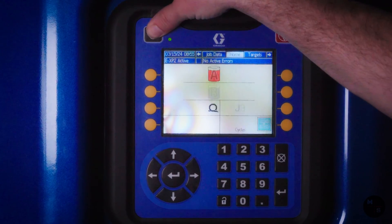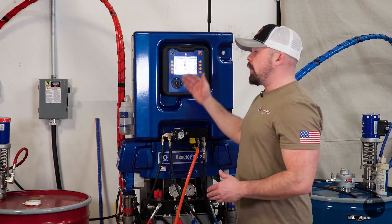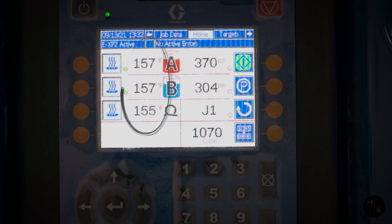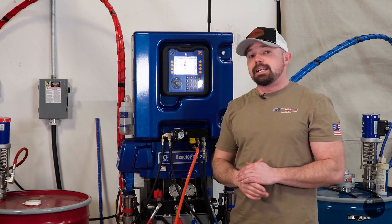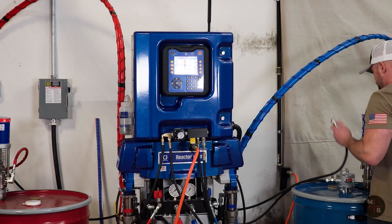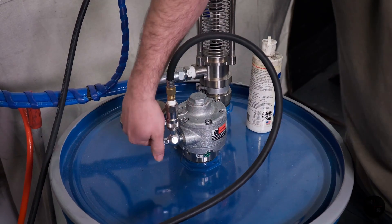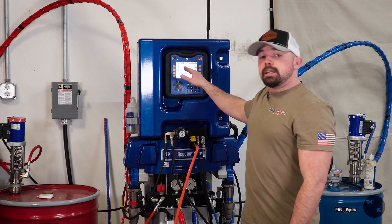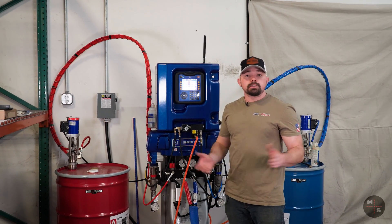Our loading screen's done. So when it's a brand new set of our MS-0311, we suggest mixing for 30 minutes. A great timer to use is actually going to be our hose heat. You can see we have our A, our B, and our hose heaters. Our target temperature is 155 degrees for all three of those. I'm going to give our hose heater a head start, because that one takes the longest — about 30 minutes to heat up to 155 degrees in the morning. Now that's heating, let's come over to our resin drum. We're going to fire up this agitator, but first I'm going to drop in a drop or two of air tool oil to help the longevity of your agitator. Kick this thing on to about half speed. Now your hose heat is climbing up to 155 degrees and you're agitating your resin drum.